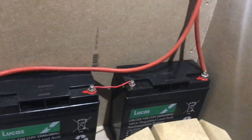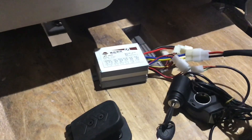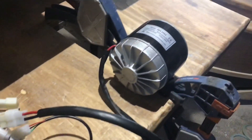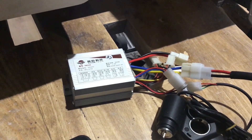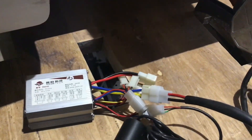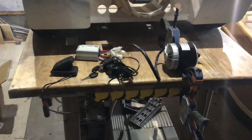I've put heavy-duty wire on the batteries and joined it to my connector. That connector has got to go to the speed controller, which I'll be doing in a second. The foot pedal, the ignition key, and the motor have all been connected to the speed controller. You can't really get it wrong because all the connectors are either different sizes or the opposite way around, so there's only one thing that each one connects to. I've also put clamps onto the motor because if this thing starts spinning I don't want it flying off everywhere. I'm a bit nervous — let's see if it works.